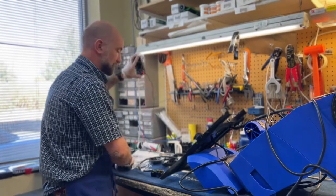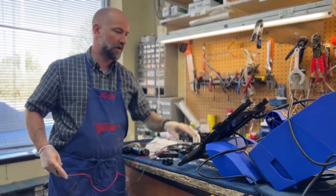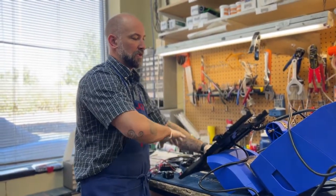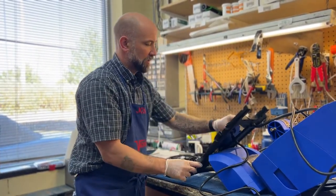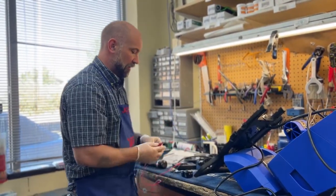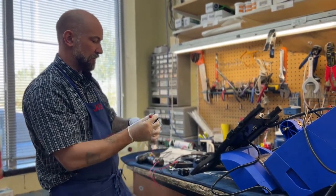I have tested this cord. On one end we have the plug, and on the other end is where the cords come in. If you trace the cord on your Rug Doctor, the handle comes apart easily — you just pop the screws on the back. You trace the cord, you'll see it comes in here. You have a white wire; the green is not relevant to this — the green is simply a ground. One of your positive or negative wires does not have continuity; power is not flowing through it.